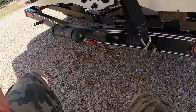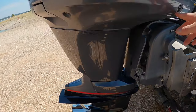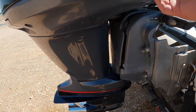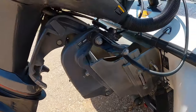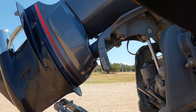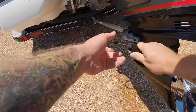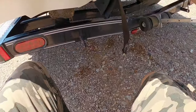Make sure you remove your drain plug. Good old Skeeter — no water inside, not a leak on this boat. Then, especially if you have zebra mussels in your lake, tilt your motor all the way down to drain that water out of your lower unit — there could be zebra mussel larvae in there, and if you go to another body of water you'll be spreading them to other lakes. Trust me, you don't want them in your lake. After that, raise the motor back up, grab your transom saver, put it down here onto the roller in the middle, snug it down — not too much, just enough to keep it tight. Bring your strap back around the motor. Get your other strap, come over to the other side, and reinstall that one as well.